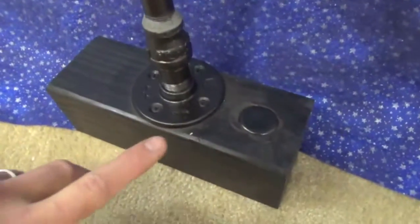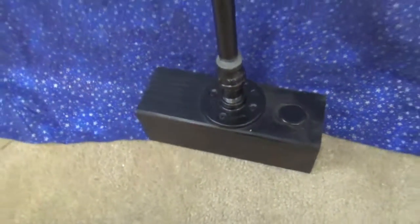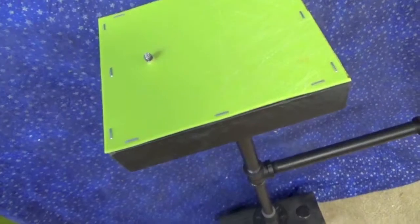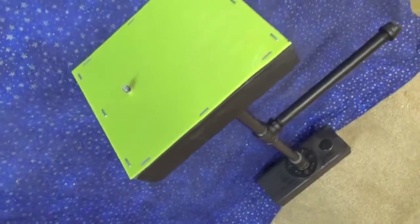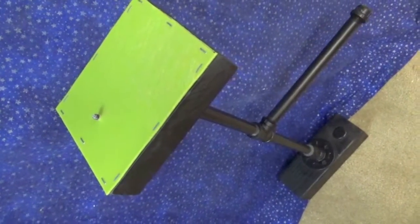And then down here at the bottom, I actually bored out a hole towards the back of the stabilizer, approximately 1.5 inches deep, and I filled that with molten lead to create a little bit more weight. And actually it balances it a lot better. So there you see, that's the finished stabilizer, and I will link the very first video I ever shot with the stabilizer in the description below.